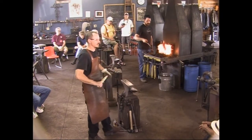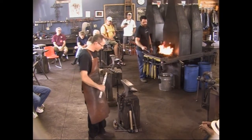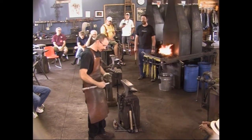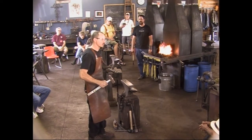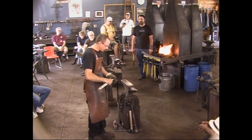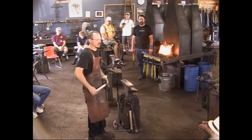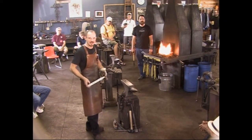This one you'll notice is a little bit too loose, so I've got to put another one in. But I try to make a tap-in tight fit, and I don't wedge my set tools. I leave them with a longer handle and let them kind of bounce and float around. There's less shock coming through the handle. But this is the best trick that David Norrie ever taught me.